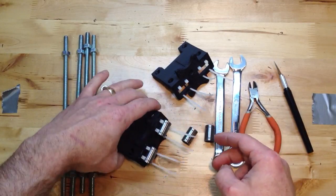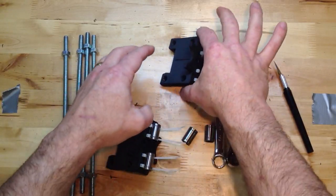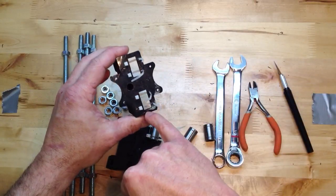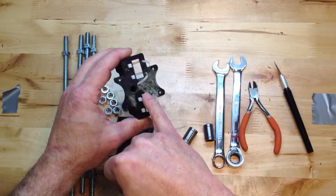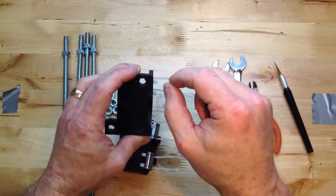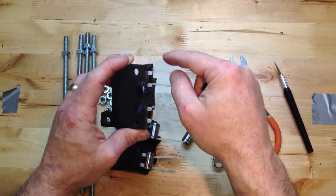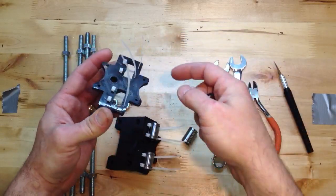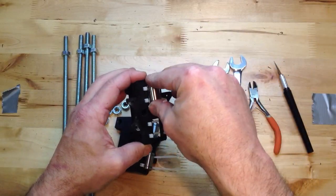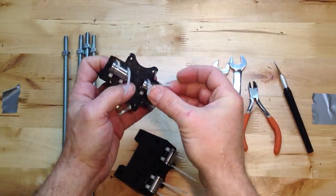Sometimes you may actually find they're going to hold themselves in there before you even zip tie them closed. You might find that occasionally you have to clean out this side or this side because the first layer of a print is actually a little more flat — it's squished down a little bit more on the bottom. So you may find there's a little flare at the bottom of your parts, and sometimes that flare can interfere with the correct dimensions. But this was no problem — this fits together really well.